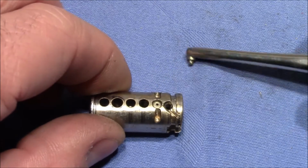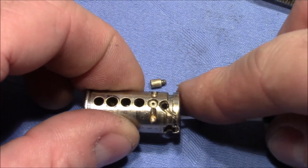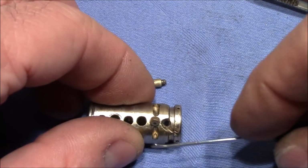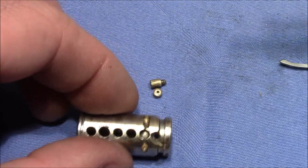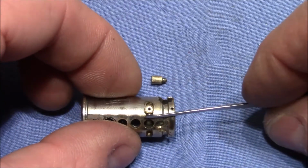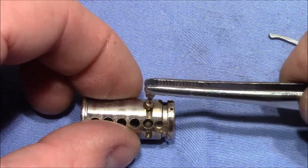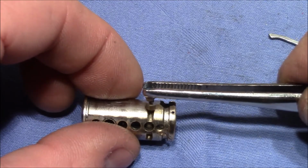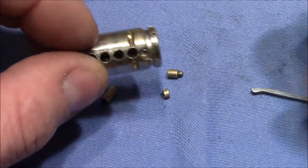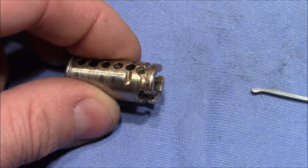But if you pick it a little bit further, the wafer comes out, and the wafer then can slide over this groove, so it's wide enough, or the diameter is large enough, to slide over this groove. On top of that, you would have the T-pin here, and everything's good, so then you can open up the lock. Okay, for showing you the rotation limitation, we have to reassemble the lock partially.